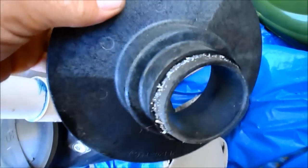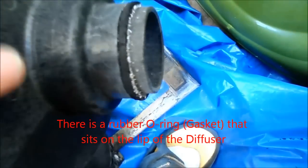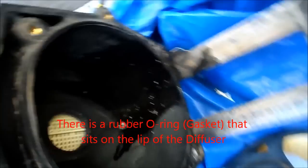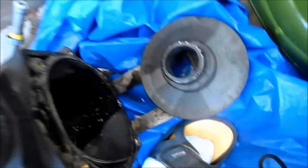The diffuser is a very important part of your pump. You can see it sits right in front where the basket is — that's the first part of the pump where water goes through. This one here has a pretty worn-out diffuser gasket. The diffuser pulls the water to the impeller, so if it's warped or melted it's not going to pull the water and you're going to have a pump that's almost cavitated.